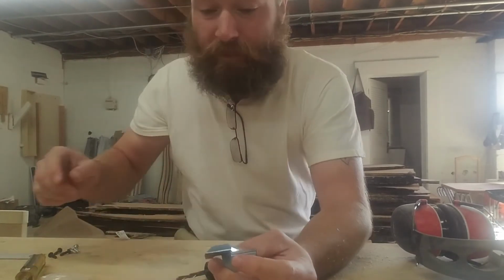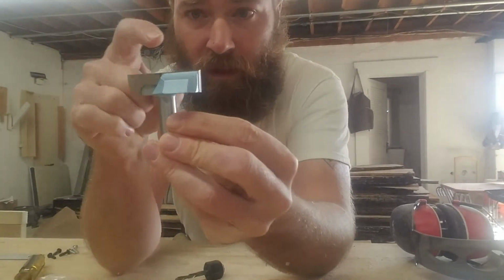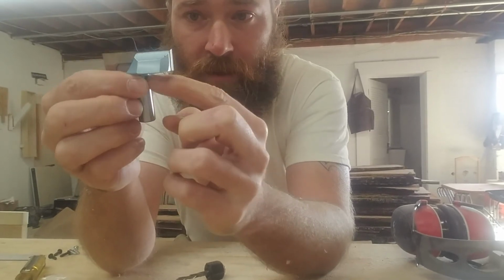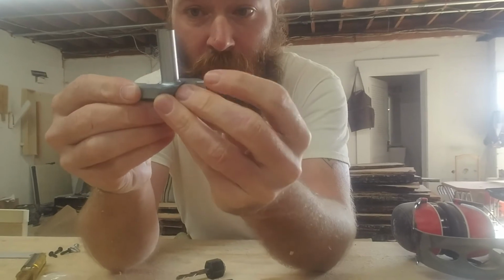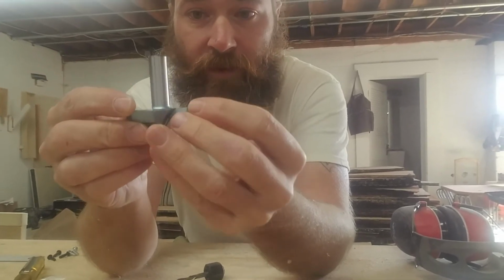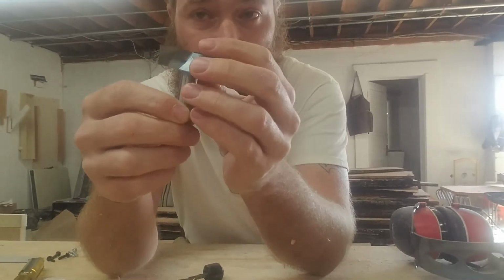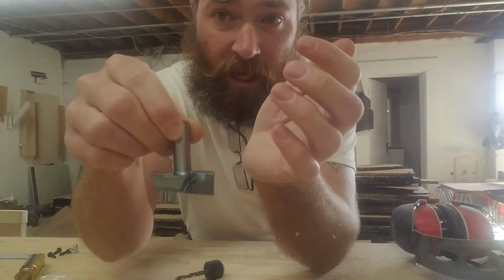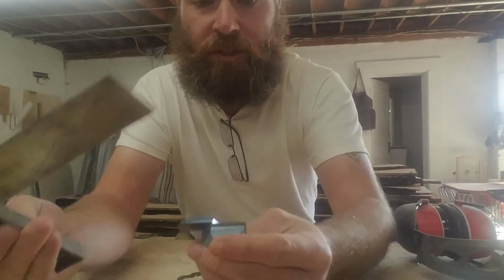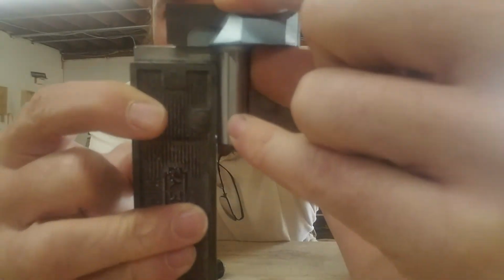it starts coming apart. And one thing I do want to check, because I've had this happen before with bits, is that the teeth of the bits as well as the head are square to the shaft. Now, I've ordered bits before and bought bits right off the shelf that shouldn't have made it through QA because they've gone up into the shaft, and then I've started to use it, and what you can't see with the naked eye generally is a slight shift in the bit, and when you start to cut, instead of it cutting flat, you get a slight angle. And so I want to try to check using my square here and my eyeball. And we're going to see.